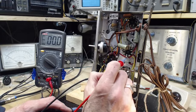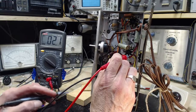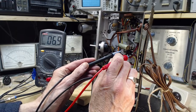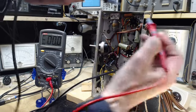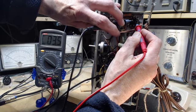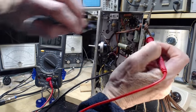Let's try this too. It's pretty much in the clear. So 2 looks like the yellow is the heater. The yellow wire is the heater wires. 2, and so we should get 12 here. 10, so it's a little low. Up here, just using the yellow wires now, not even paying attention to pin numbers, but I can see it's 2 and 7. Don't touch the chassis while you're doing this. Can anybody see the meter? 10 again, 11, 10, 11.